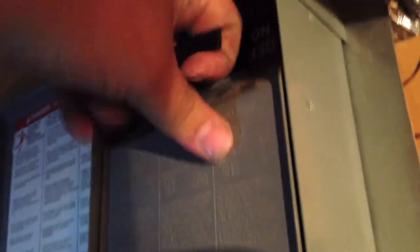I'm gonna pull my disconnect now. Actually, I don't think I even need to jump it — my thermostat is still set calling for fan. So I'll put this wire nut on here nice and tight. All right, all the other ones look good.